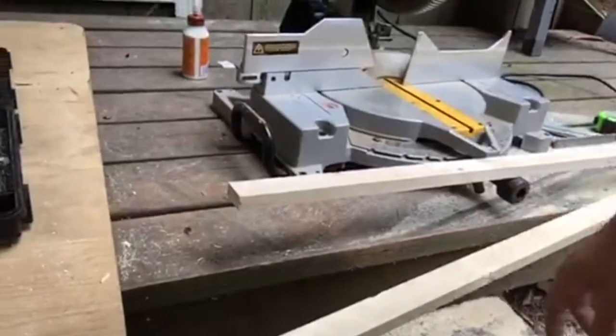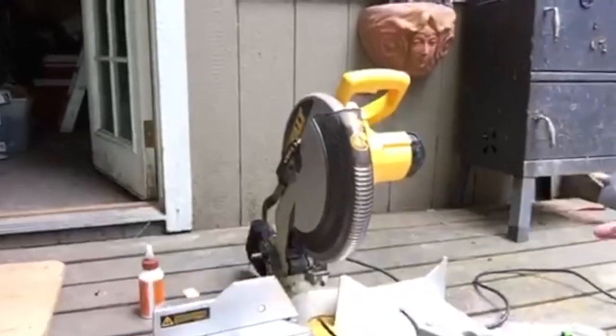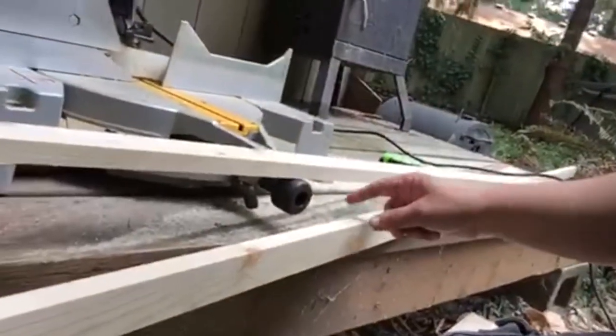Step 364 — this is an extra step. We're going to take this piece of 1x1.5 and cut it. We're going to put it along the edge here so it makes the edges look nice. You don't have to do it — it's totally extra. It requires a chop saw or a miter box, but you can hand-do it: mark your 45 degree angles and use a jigsaw to cut it out. Totally will work. Remember, putty heals all wounds — paint makes a carpenter what it ain't.